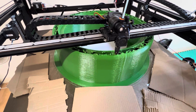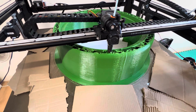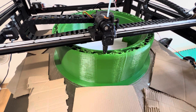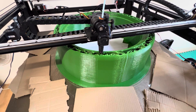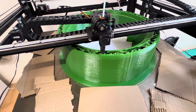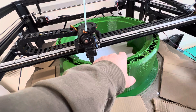Travel is still at 70 millimeters per second and the acceleration is a similar number, so it's taking about one second to get up to speed. That has really helped and I haven't had any lost prints. The other place I'm finding that useful is with the lightning infill I'm printing at the moment — because I'm priming the nozzle back and it's oozing a little bit, the low acceleration is actually really helping reduce blobbing of the material underneath.